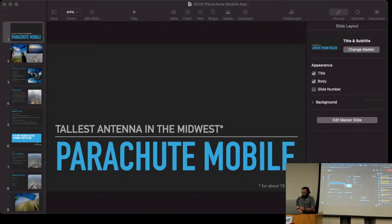There's a lot more activity happening now on 2 meter sideband. If you tune around 144.200 or so, there's a bunch of guys getting on there. And on Friday nights, there's a net out of Sherwood, Ohio, on 144.230. It's vertically polarized sideband, because this guy figures a lot of people have these all-mode rigs, but they already have a gain vertical for 2 meters. Why don't we use it? And that's what he's doing.